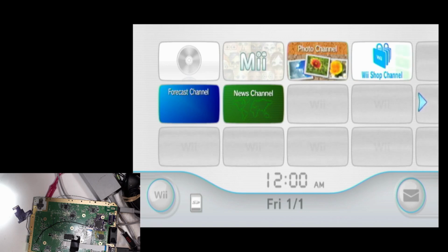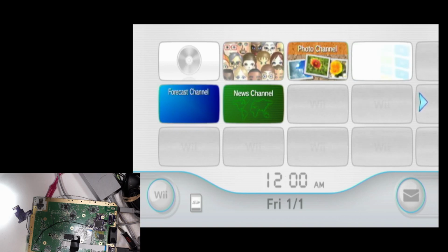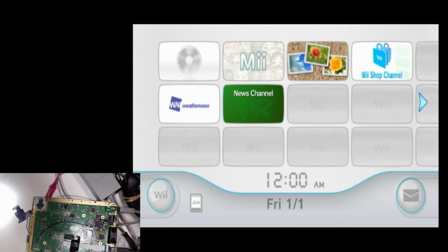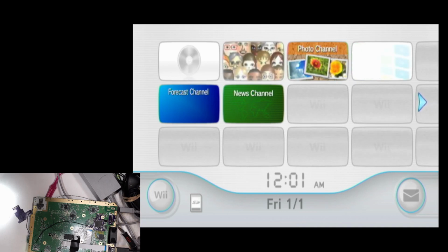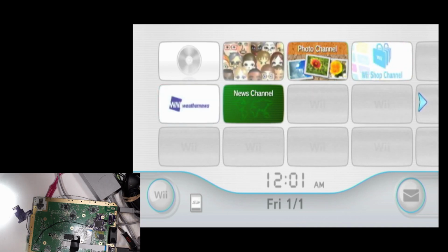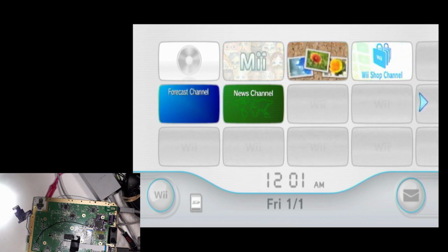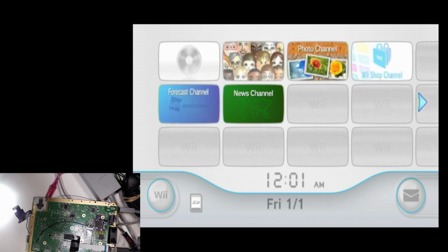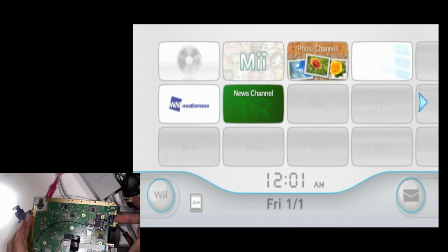So because the resistors were not set up properly, the pin on the HDMI cable that basically signals the television that something's hooked up to it was not connected. It was not getting the correct voltage, so it didn't detect that there was actually a video source. So I swapped those around, and that fixed it. And so the BOM is updated now, so that shouldn't be a problem now. Okay, now the other problem being the infrared receiver. I still don't know about that one.